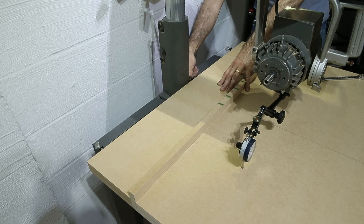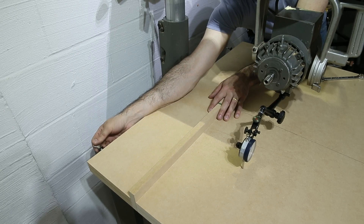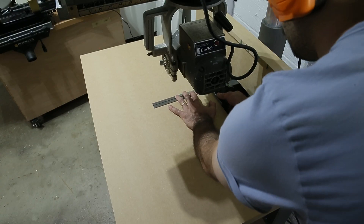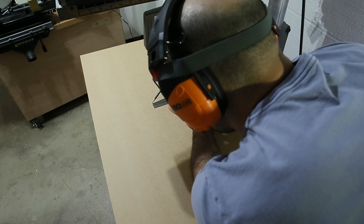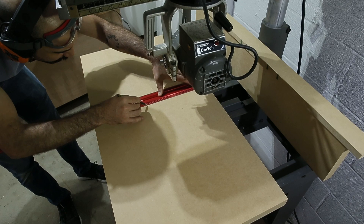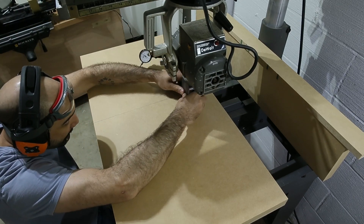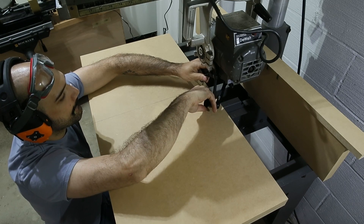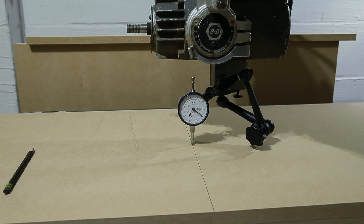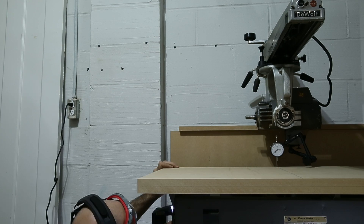The fence itself is held tight against that reference surface by these three clamps at the rear. I'll be able to fine-tune this later but I want to get the table screwed on as square as I can get it right now. I used my combination square to draw a line perpendicular to the back edge and then extended it with a straight edge. I attached a dial indicator to the bottom of the motor and tried to get the line on the table aligned with the travel of the tip. Once I had the position as close as I could get it by eye I screwed the table down to the stand from below.